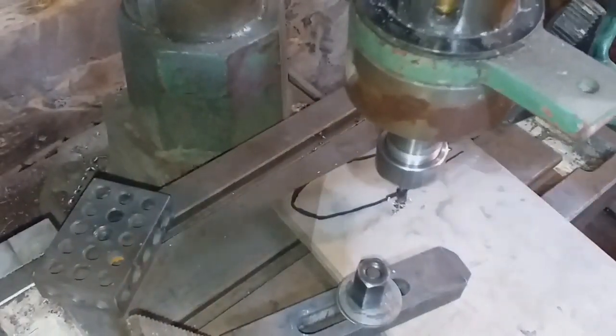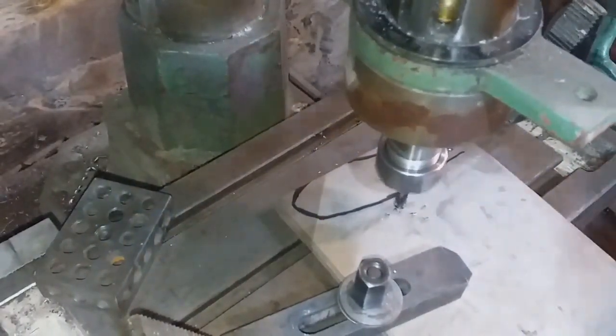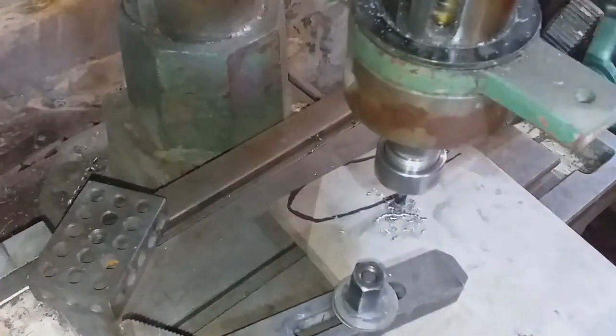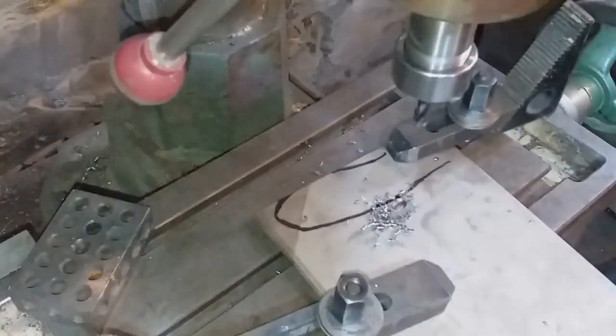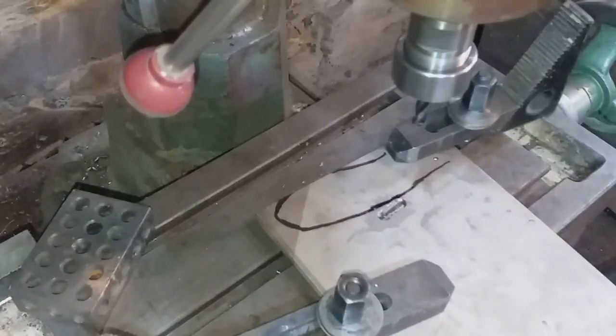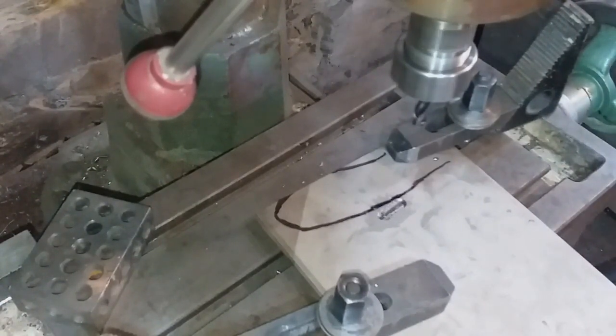The frame lock side of this knife is cut from a piece of 7mm thick grade 5 titanium. So it took probably at least an hour or so milling the actual scale away from the rest of the block. Again, this is no mean feat. You have to spray very cold compressed air at it the whole time, to save overheating the drill bit. It's very slow, painstaking work.